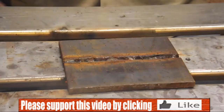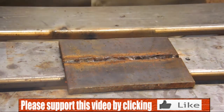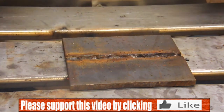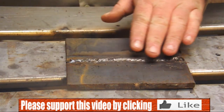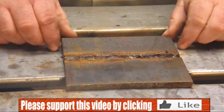If you wonder what I'm doing here, my keyhole got a little bit too big. There's our root pass - it's down in there, and there is the prettiness. You can see the nice, even beading on the back. What we've done again is we have welded the back from the front.